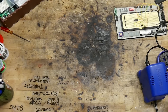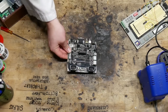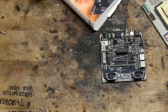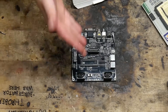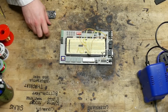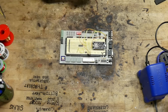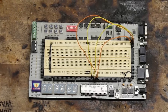I want to use this old Propeller chip. The Propeller chip is a very weird microcontroller — this is where this gets a little cooler. It's not that practical but it has video hardware on it. They made a game console dev board for this chip called the Hydra, and they sold it with a book that told you how to make games. This is how I learned game dev before I learned Unity — on a bespoke hardware platform with 32 kilobytes of RAM. We're going to be using it today as a graphics sub-processor. The ESP8266 is going to get the Twitch chat as a serial signal and send the username and message to the Propeller chip, and then it's going to display it on the screen.